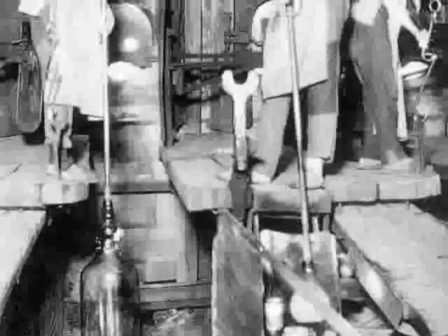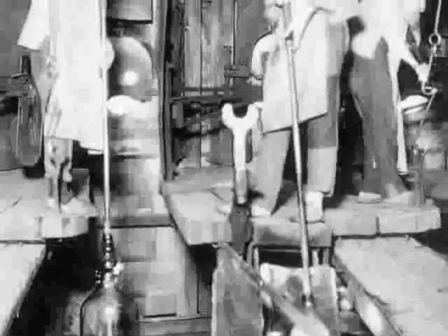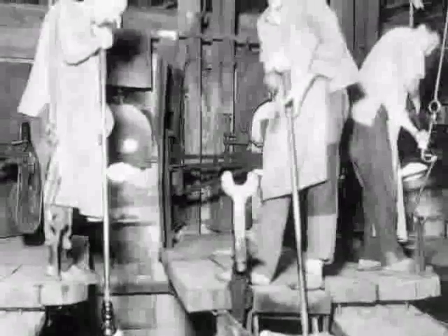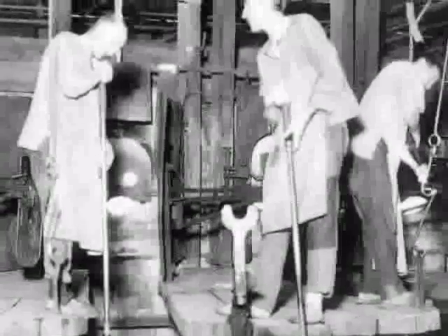At the left-hand side of the model you can see in the back where the workmen are splitting the cylinders lengthwise, and then they have to be put back into the furnace and flattened. What you get is a large flat sheet, so you can make much larger panes by this method, but they were somewhat wavy because of the fact that they were split and flattened. If you look at Victorian windows today, you'll often see that half of the window or even the whole sash is one piece of glass, but you can see the wavy lines.